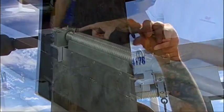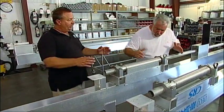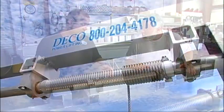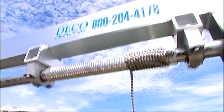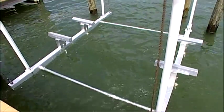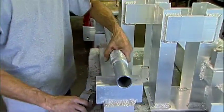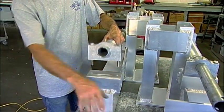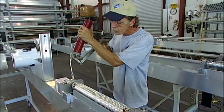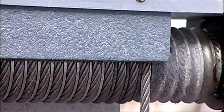This cut groove area is where the cable wraps to lift the boat, and this is called our Cable Retention System — a patented item here at DECO. We have a deep-groove winder that the cable rides in. The winder is a quarter-inch deep with 5/16ths cable; it sticks up slightly over the winder. We put a plastic retaining clip over the top so the cable can't come out of the groove.